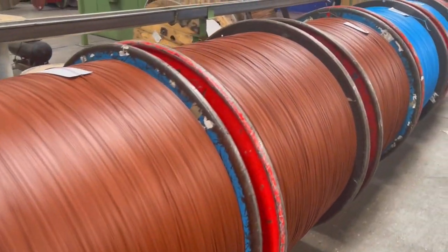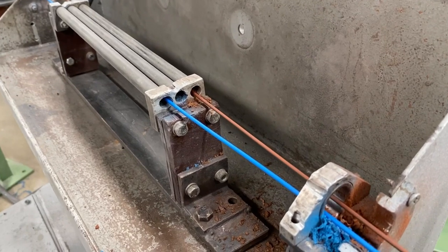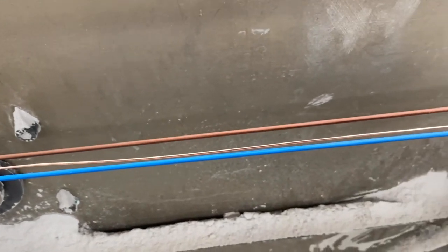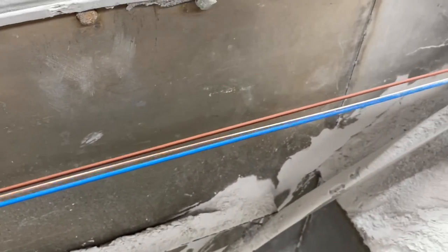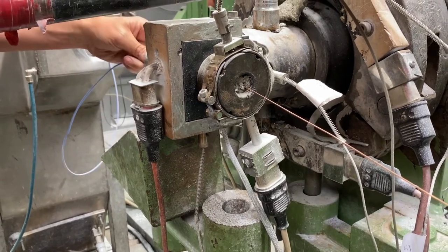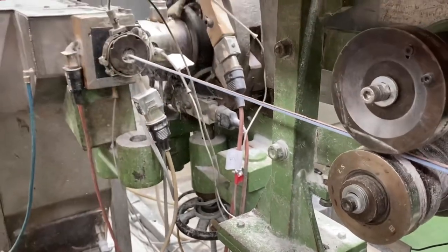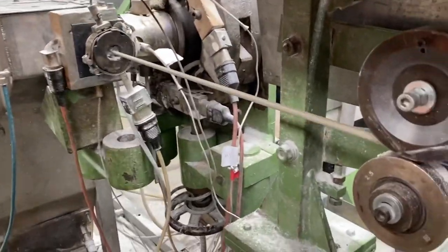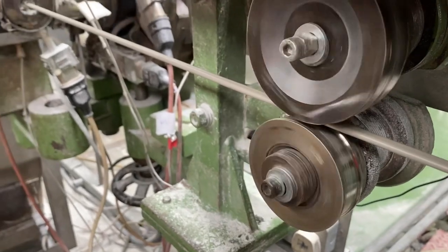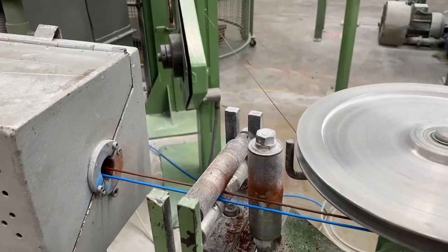The cores are stored on the factory floor and when ready to sheath, we take a blue, a brown, and a bare earth wire from the wire drawer and thread them into the machine. The cores pass through a talc unit - a chalking machine - to coat them, then the operator feeds them into the back of the extrusion head through the point and die. The point holds the cores and bare earth wire in place, and the die covers them with the sheath shape. As the machine starts up, we pull a purge valve so molten grey PVC comes onto the cable. An indent wheel then embosses 'Doncaster Cables England' onto the outside of the sheath.